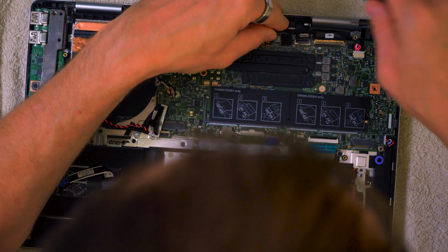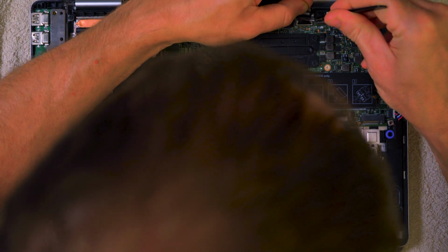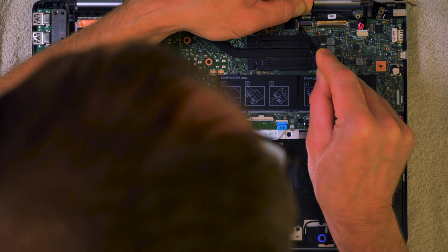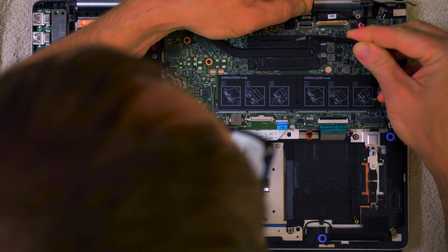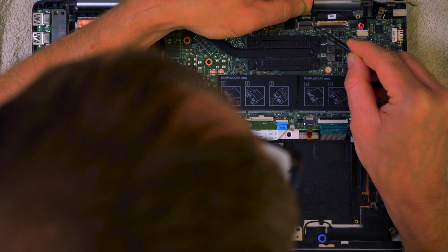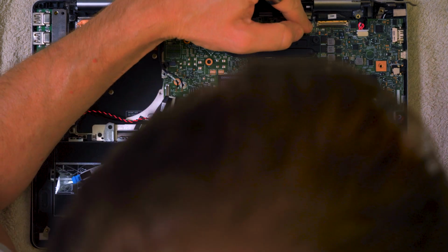There it is. So this one is going to be, just pull that black bit of plastic up vertically, and then get the ribbon connector in. And then you're just looking for the two white ears here to just be sticking, and just slightly clamping it in this plane here to stop it slipping out this way. So these two white ears, if they're sitting behind the corresponding ears on the ribbon connector, you know it's good to go. And then just fold that over, push it down, and that's fine. So they're now all on.